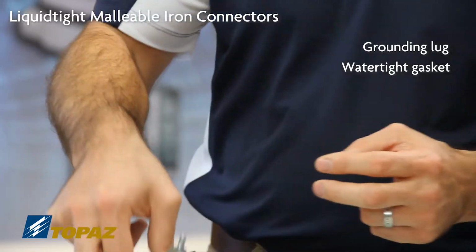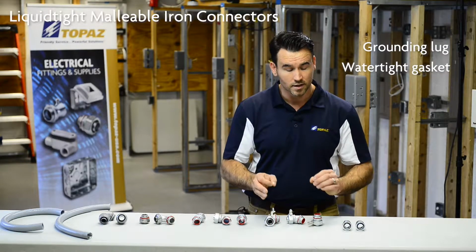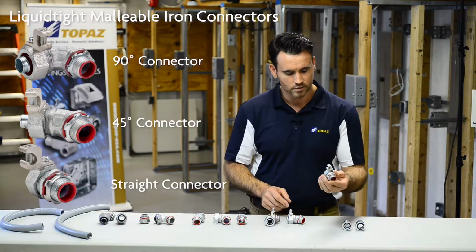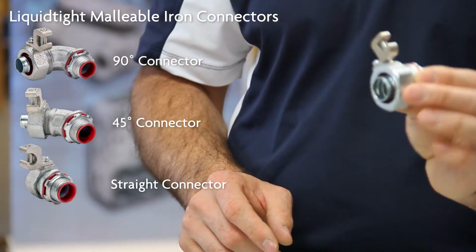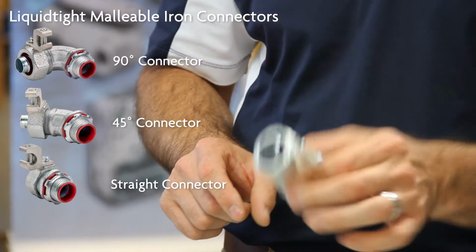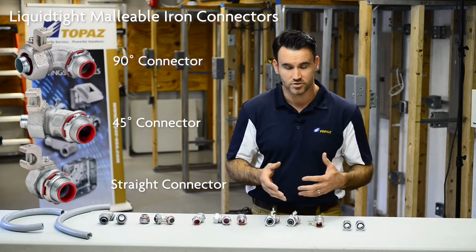Once again, these particular connectors are made of malleable iron, and they come in 90 degree, 45, and straight. As you see here, here's your straight connector. And this is your 45 degree. So based on the application, you would choose the connector that was best suited for the job.